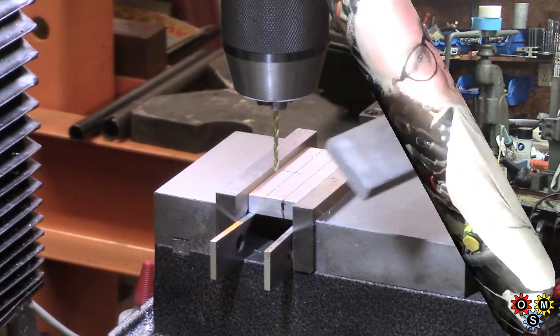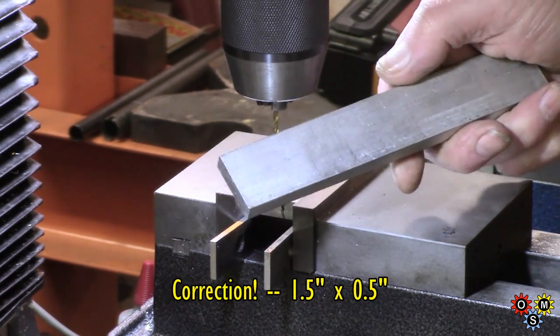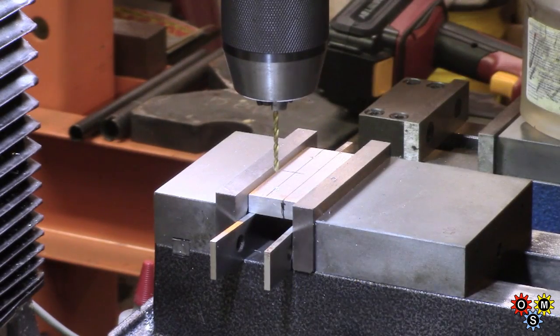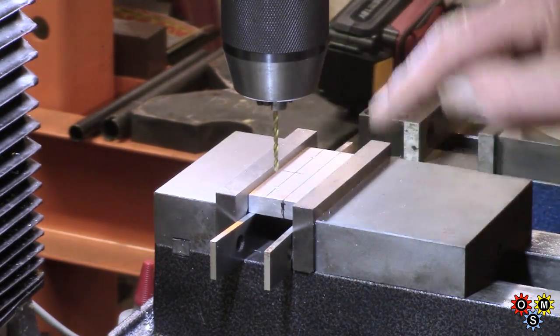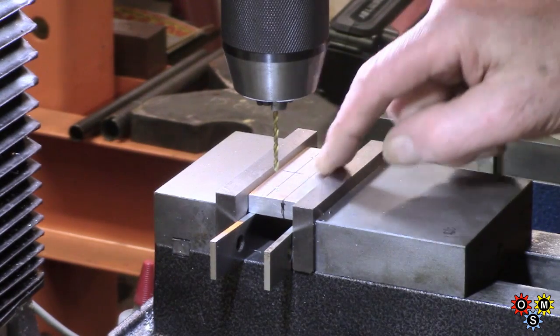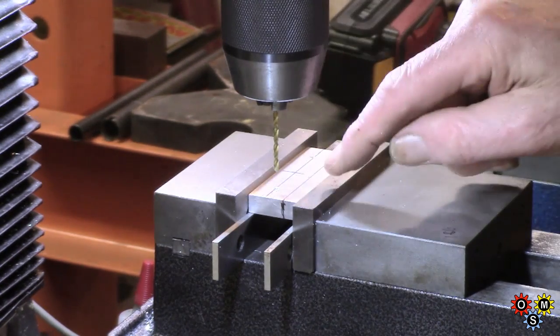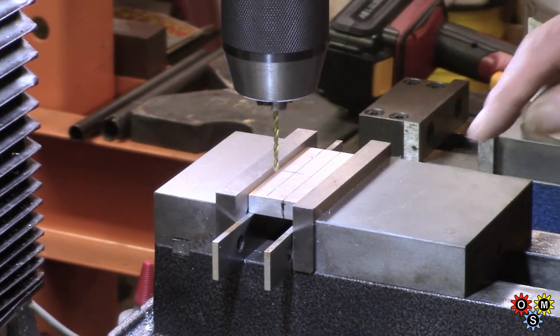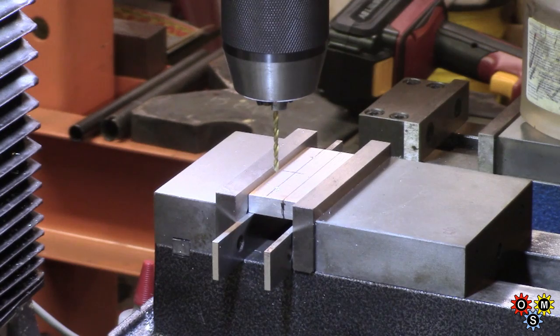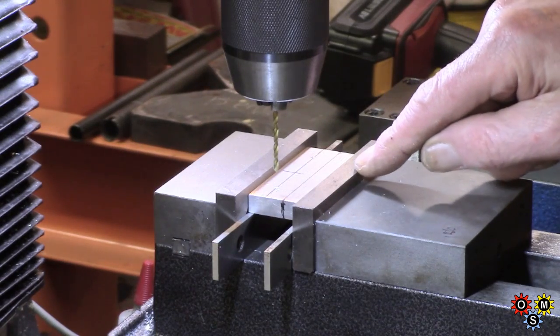Here's some inch-and-a-quarter by three-eighths rather rough old aluminum bar. Taking a piece off and cleaned it up on the belt sander — I'm too lazy to mill it all round because it's not super critical. What we do want is two shallow pockets for some neodymium magnets, so this can go onto the lathe rail as a means of attachment for the vernier.